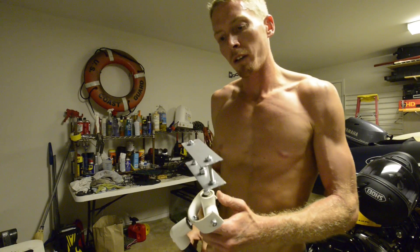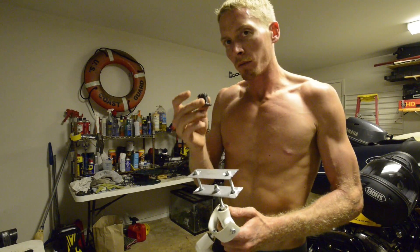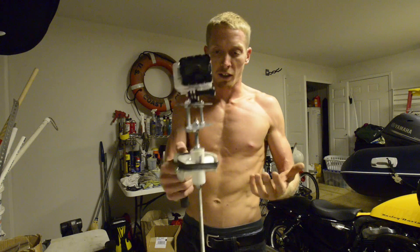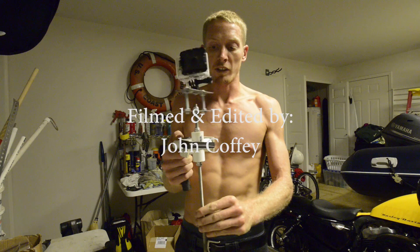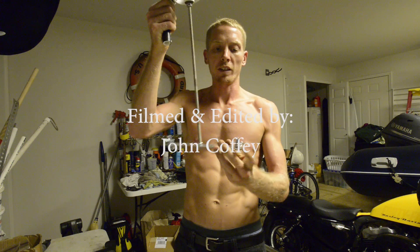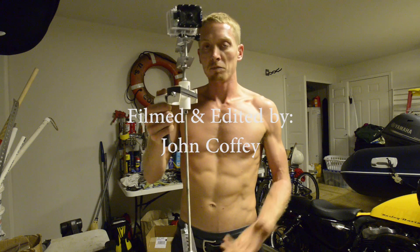Next step, we're getting ready to mount the GoPro. We want to use the quarter-twenty mount that GoPro sells — we're going to mount that right up here, so we'll need to drill another hole. If I move it side to side or forward and backwards, it seems to be pretty steady, which is awesome. I'm not really going to add any counterweights, but you can put some wing nuts down here with five-sixteenths threads. Thanks for watching — make sure you subscribe.